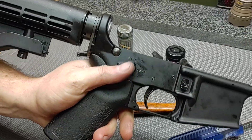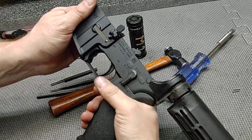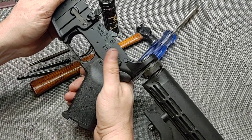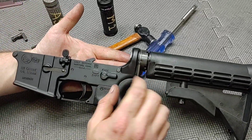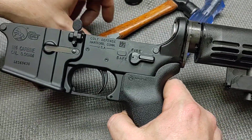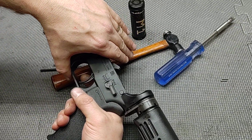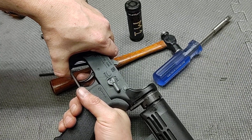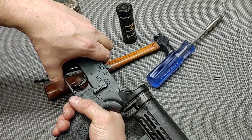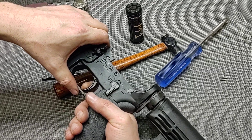As a lefty — nice and smooth. As a righty — don't even have to shift my grip to actuate and turn it back off. Very smooth. Let's check for function. Once installed, cock the hammer, hold your finger nearby just in case the hammer fires accidentally, mash the trigger. Take your trigger finger off the trigger and put it to fire — the hammer should not drop. Then fire it; don't let it drop by itself while holding the trigger rearward. Cock it, let it go slowly, and make sure the disconnect is grabbing.